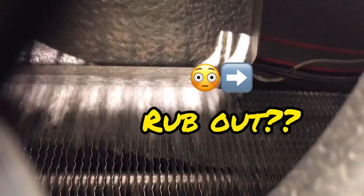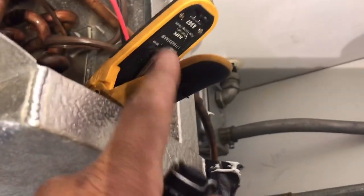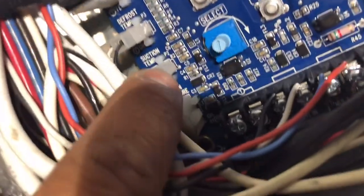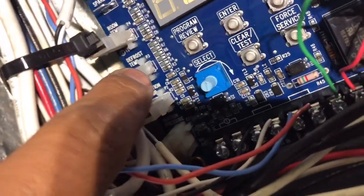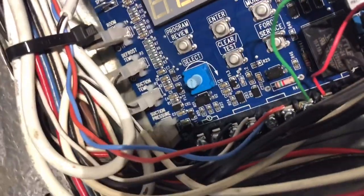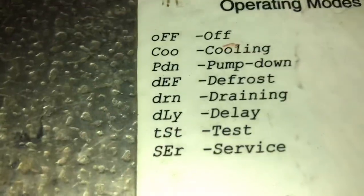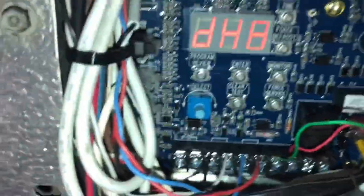I just let it run through a cycle — I just wanted to see exactly what it was doing. And as you can see, we have a lot of ice left. Reading 65 degrees. This is the sensor that's at 65. So all we're going to have to do is change them over right here — defrost temp and suction temp — and then verify that our repair is good. We'll probably throw it into another defrost. As you can see, it's in drip mode or drain — DRN, draining. So it's drip mode; they just called it draining on the Beacon. Let's go ahead and change this up.